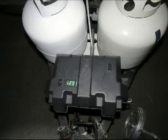And then when you're convinced that everything on your 12 volts is working, go to your shore power, plug into shore power and make sure your battery is charging. Now my battery, I put a voltmeter on the top of it, you can see here, it's a digital readout voltmeter, and anytime I plug into shore power, I can see the battery instantly jumps up to 12.9 or 13.8 volts. Sometimes with the new WFCO, it goes all the way up to 14, which I'm pretty impressed with, because that'll charge the battery pretty fast.